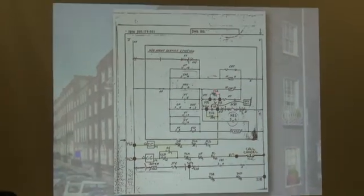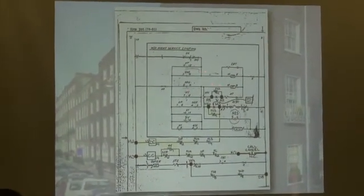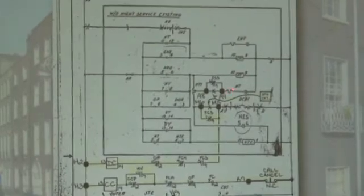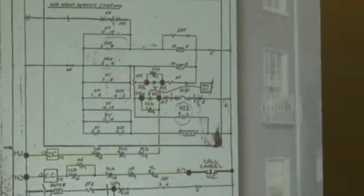You'll find if you look at the prints, FS is all picked up when we first go on fire service, and they stay up through phase 1 and phase 2 operation. So what we're telling you is go ahead and hook A4 to the NT cap, NT resistor, and A8 should go to NT1 resistor. That's the way we're going to write it.